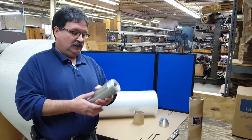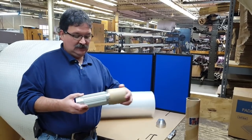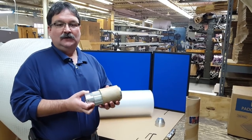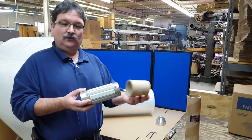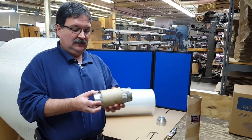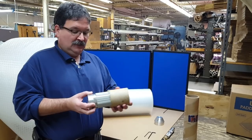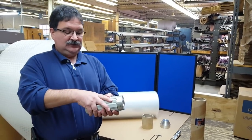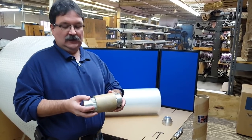CAC's CoreLock air chuck is a leaf-type air chuck, and cores will slide easily on and off the chuck. Compared to what's called a bladder-type chuck, there's no rubber that comes in contact with the core, so sliding the core on and off is a very easy procedure for your operator. In the deflated position, the segments are compressed and the core can slide on easily.